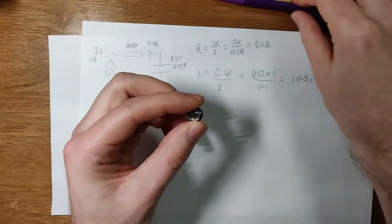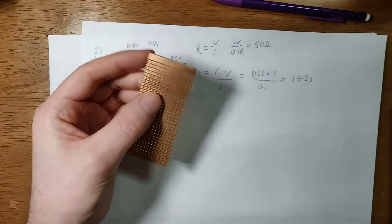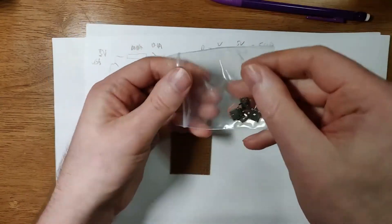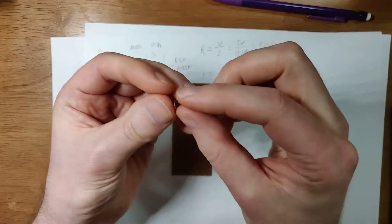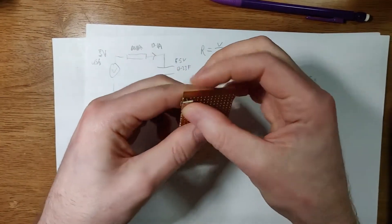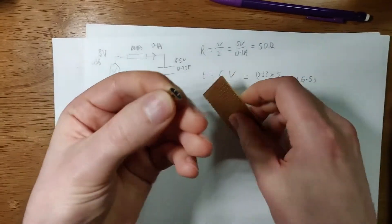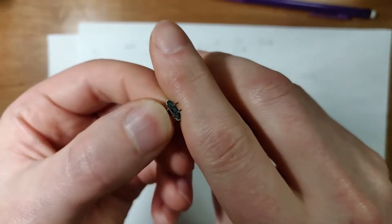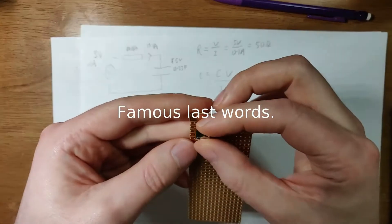So what I'm going to do now is solder up a simple strip board. I have a micro USB connector here. I'm going to solder that to the strip board. It's a surface mount component — a nice little USB header that only has the ground and power pins connected through. Relatively easy to solder up.